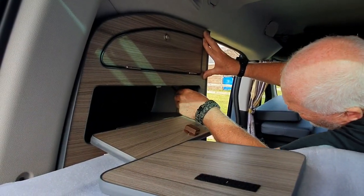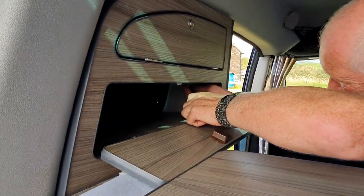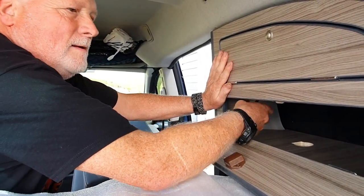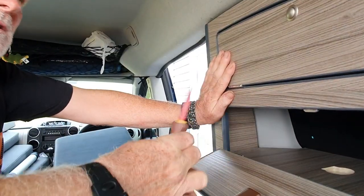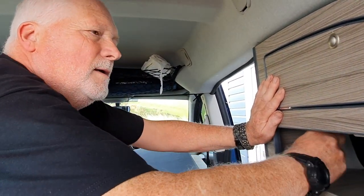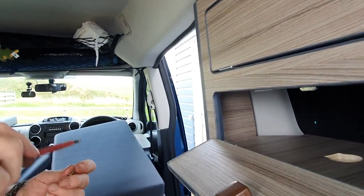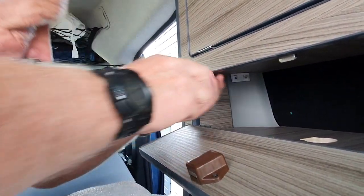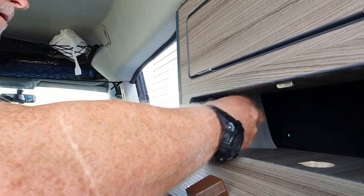In order to secure the cupboards, there are some white plastic block mounts in each cupboard — you need to screw those in with the supplied screws and they just fit straight into the plastic trim. You wouldn't think that would hold them in place very strongly, but to be honest they're such a snug fit it's just security. You will be better using a flathead screwdriver rather than a drill with a screwdriver bit, because it's just going into the plastic — if you use a drill it might be too much and you might just over-tighten it. A little bit awkward to get into, but once you get them started you're fine.